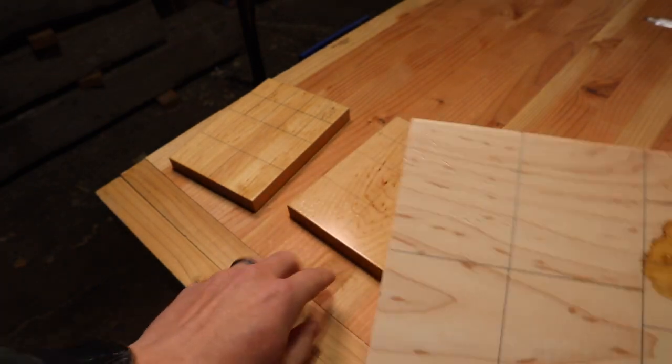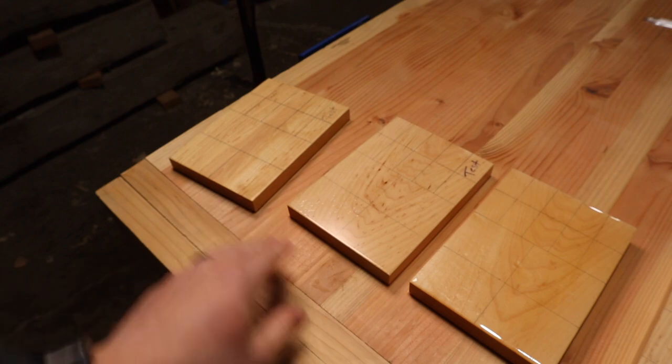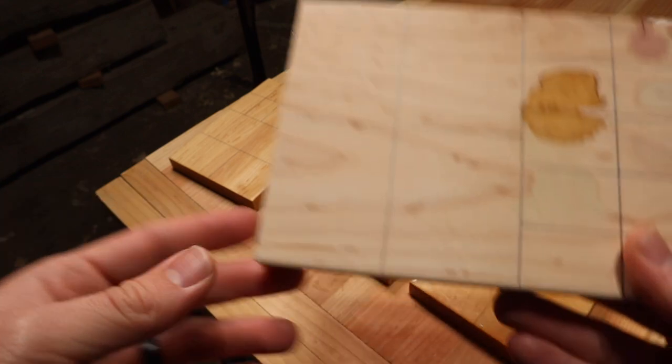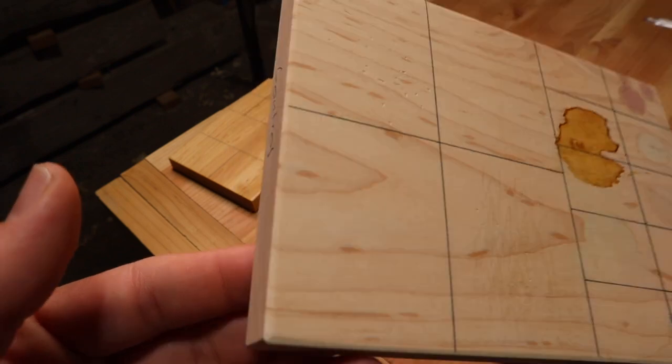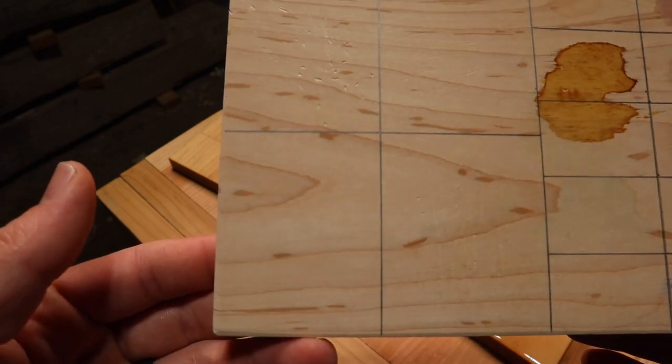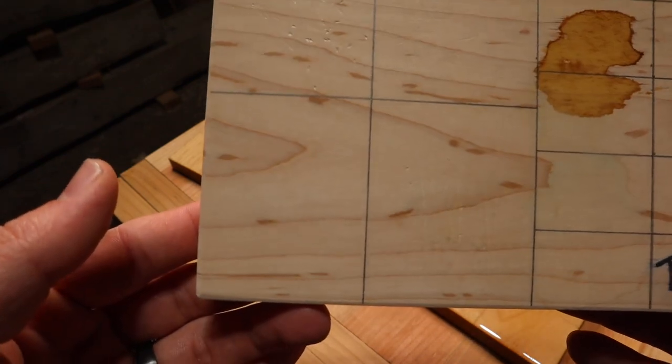There was no damage on any of them. The lacquer I expected to do pretty poorly, but it did just fine. Polyurethane was fine, epoxy was fine, Rubio Monocoat was fine, even the control was fine once all the water evaporated. So I would say the hot wet paper plate test did not distinguish any of the finishes from each other.